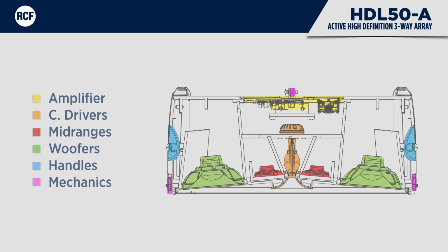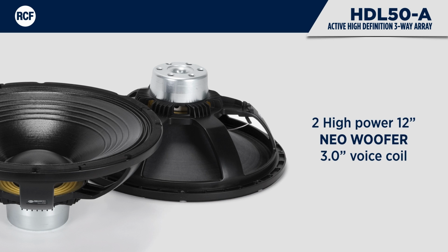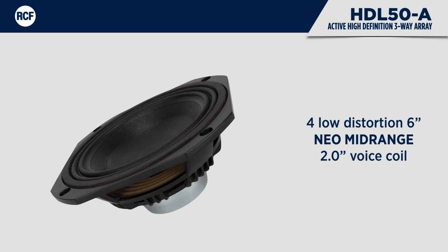The HDL50A is loaded with two high-power 12-inch woofers. They feature a 3-inch voice coil, water-resistant fiber-doped cone, and polycotton M-roll surround. The hypervented magnetic structure is powered by a strong neodymium disc. Four low-distortion neodymium mid-ranges cooperate to create a planar wave on the center of the speaker. A 2-inch aluminium voice coil handles the power, keeping a very low-moving mass.